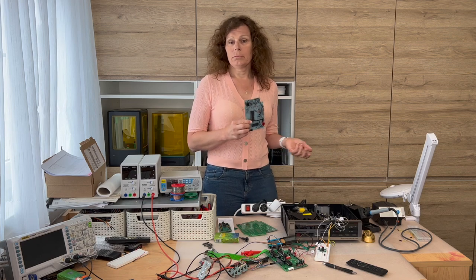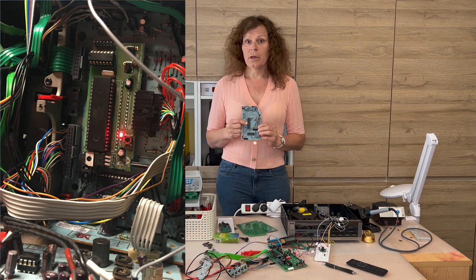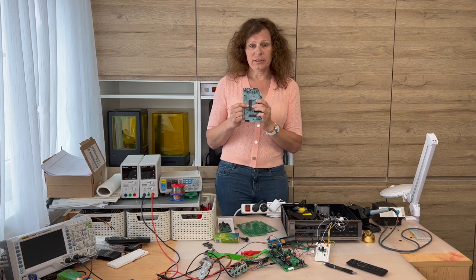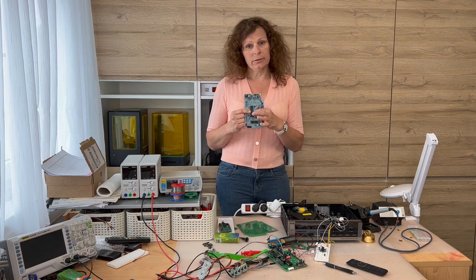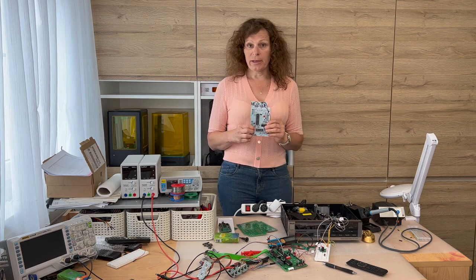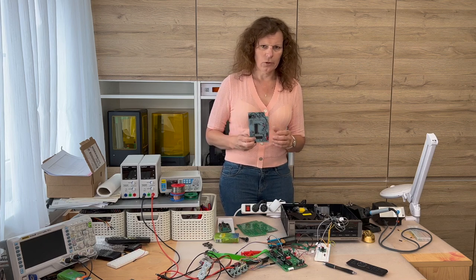For those who have seen my other videos or follow me on the forum or website, you probably noticed that I already replaced the tape mechanism microcontroller because the design has some flaws. If the tape mechanism isn't able to do what the CPU expects, the CPU hangs, and because the CD player CPU is connected directly and waiting for inputs from the tape microcontroller, the CD player also hangs. It won't be possible to press play — even if the belt of the tape mechanism is weak, the CD player won't work anymore. Not very useful, is it?